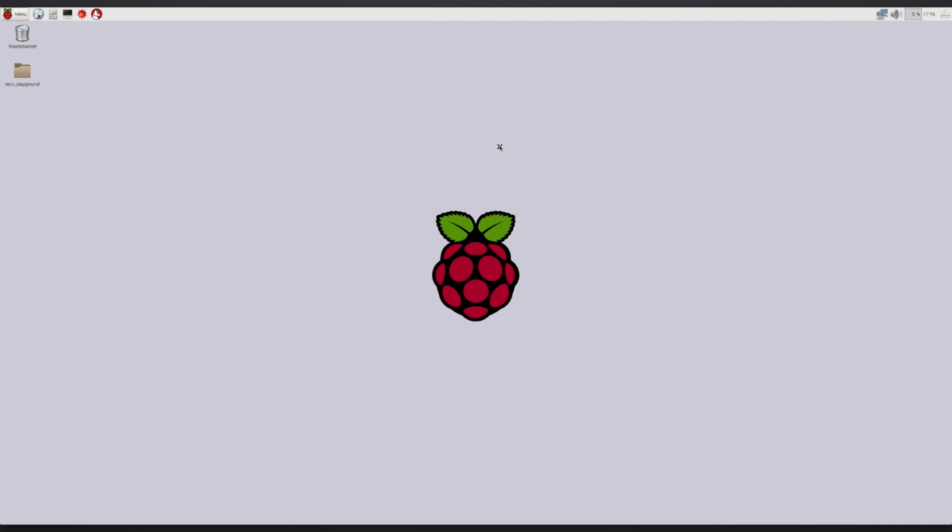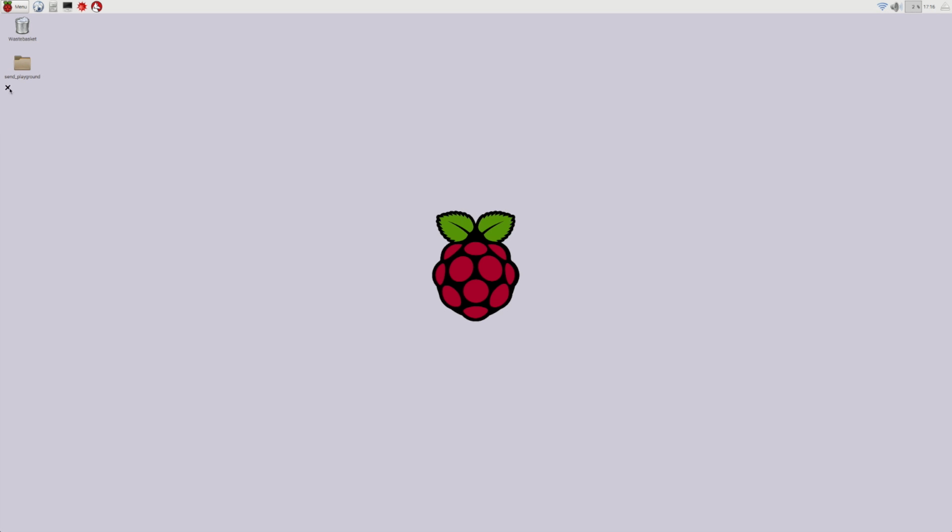After we have wired our transceivers up to our Raspberry Pis, we're going to have to download some packages and start writing the programming needed to establish some communication. What I have here in front of me is a desktop of the Pi that will be receiving our message. I have the desktop of our Pi that will be sending our message, and then I have loaded instances of the terminals; I'm connected to my Pis headlessly here. So what I'm about to do is set up one Raspberry Pi and download some packages on that Raspberry Pi, and these steps need to be done on both Raspberry Pis.